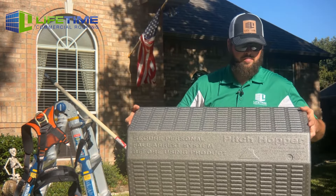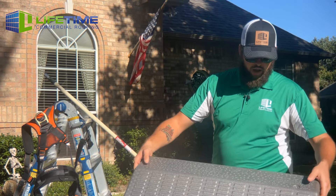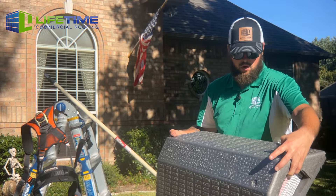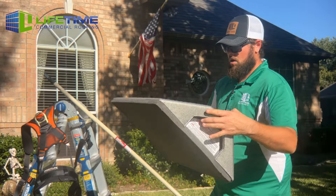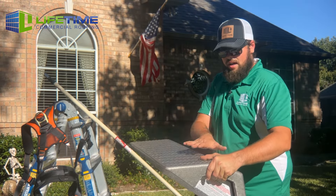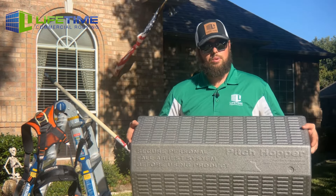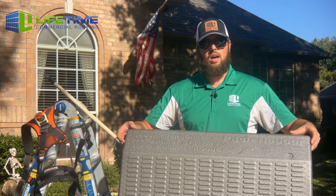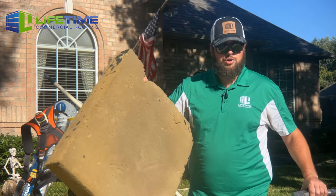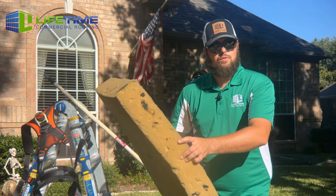This is a pitch hopper — a foam-backed, really high-density foam block that has two different angles. This angle here is for a 12-12; it will be completely flat on a 12-12, which is a really steep roof. This side is 9-12. When this goes on, the foam keeps it from slipping, and because of the geometry, when you stand on this it puts weight on the foam pad evenly and kind of locks down onto the roof. You don't want to use these without having fall protection on — it's really good and comfortable to work on, but don't trust your life to it because it's not mechanically attached. The foam back operates the same way as a high-density foam cushion, allowing you to climb up and work comfortably. If you want to use it as a kneeling pad, it also bites into the shingles and keeps you from sliding down.